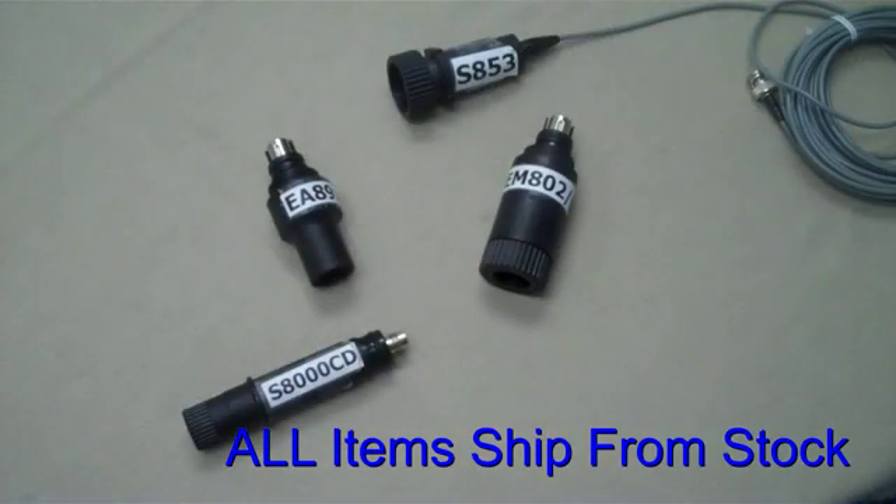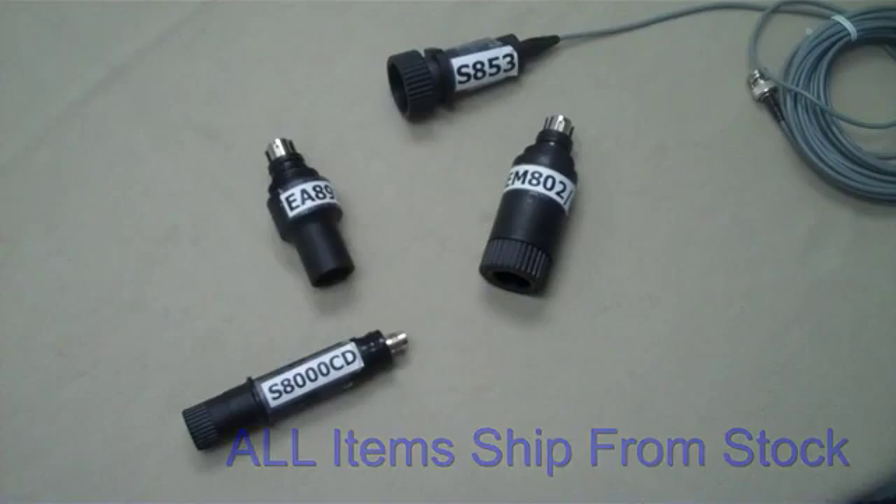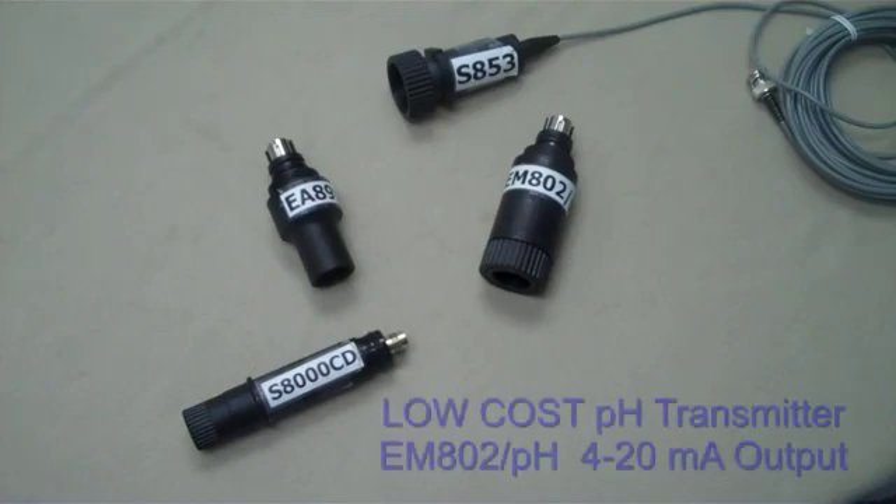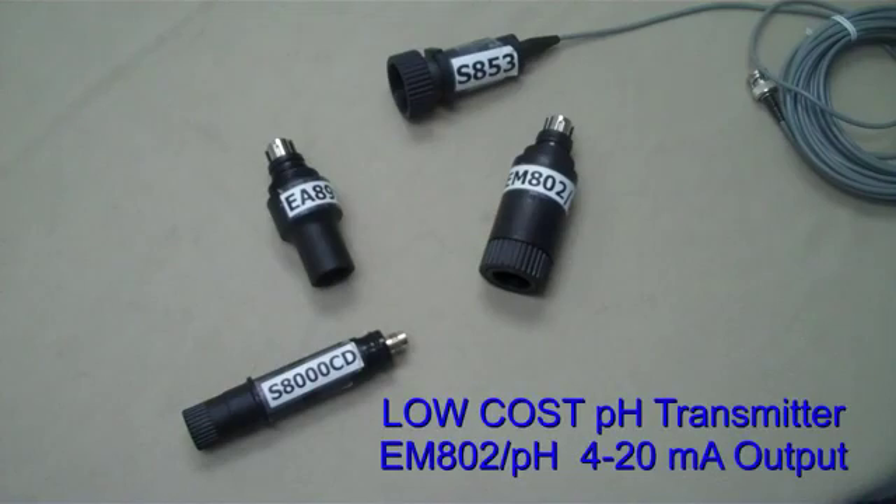The use of low-cost, powerful PLCs and DCS distributed control systems have become popular with system integrators and sophisticated end-users. Many customers use electronic data loggers to provide monthly reports to local sewage authorities or for plant quality control. Both of these electronic devices are perfectly suited for pH measurement, and they often require that the pH signal be converted to a linear 4 to 20 milliamp output to communicate with their circuitry.